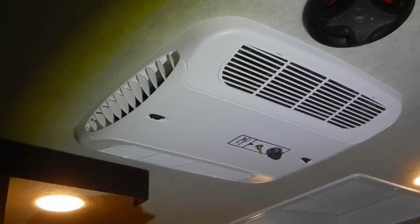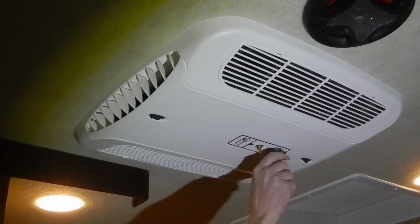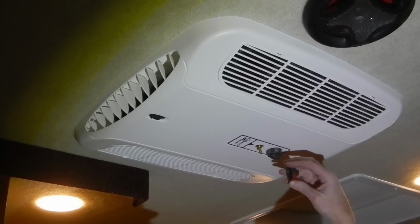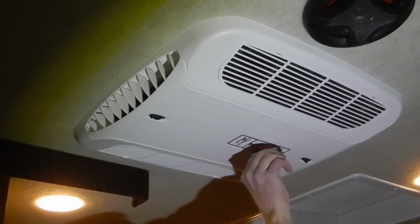Okay, so our knobs go with the power switch, the one that says off, low cool, low heat, high heat, fan only. That one goes on the front, and they have a flat portion on the shaft which lines up with the flat portion inside of the knob. And they just press fit into place, and there we go.